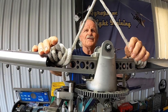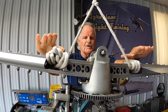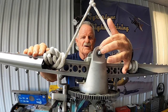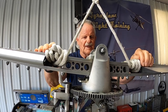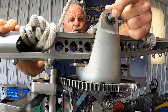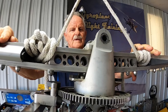The first thing you want to do is use a winch and make up your own harness, just to take a little bit of the load off. Getting the harness tight, and removing the cotter key and the lock of the castellated nut off the bolts — the teeter bolt. If you rock the blades onto one of these stops, say the rear stop, that'll take the load off and you can push the teeter bolt out. Remove it carefully.